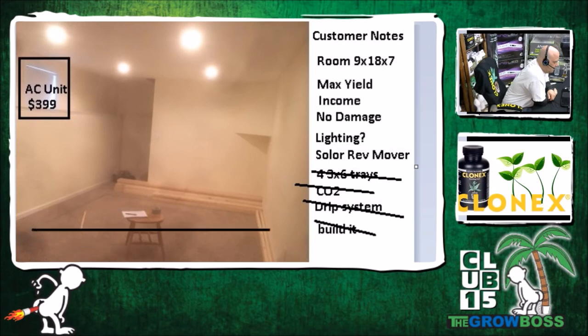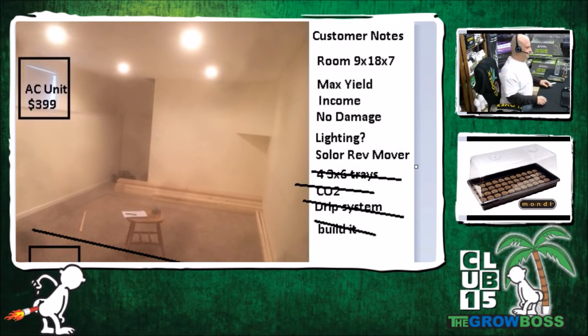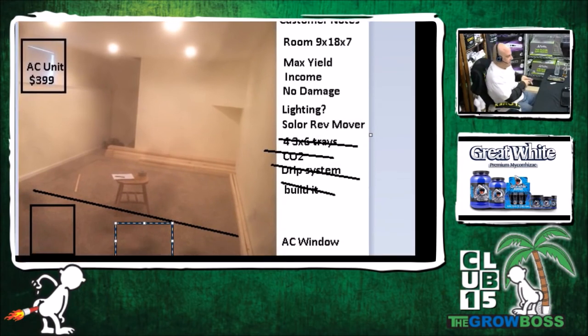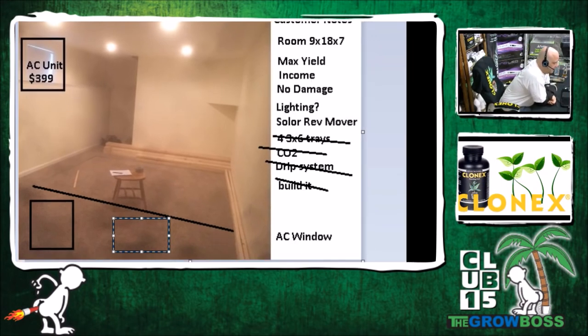I mean, wiring more circuits and stuff like that can be done if I need to. But you could also just run one extension cord, like an AWG-12, from another room, and you can light up one light with that. And now you've taken 600 watts out of the circuit. So if you find a different circuit, you can run one extension cord. But if you go up to thousands, you're just gonna run a box. Just get the wire.